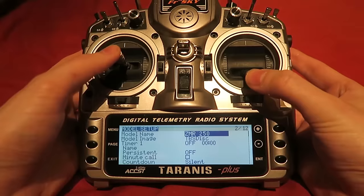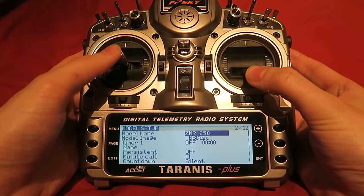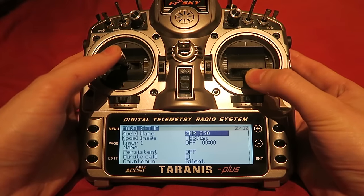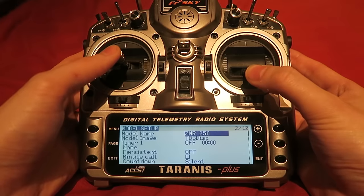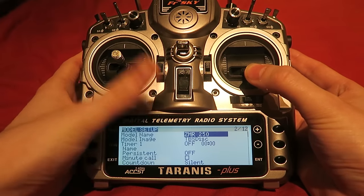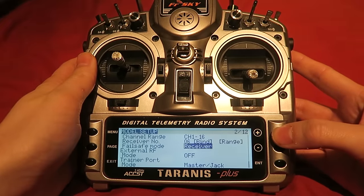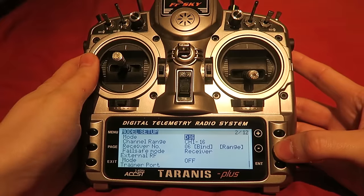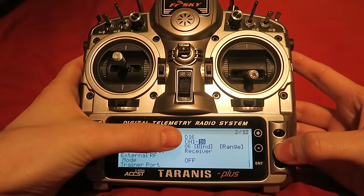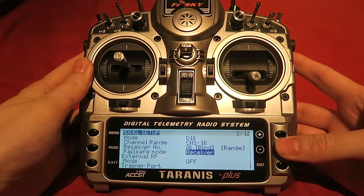Now that all the necessary wires are connected, we bind the receiver to the Taranis and set up our model. Mini quads are fairly simple, so this shouldn't be too taxing. I have created a model called the ZMR250. I have set the model image to TBS Disco. I have set the mode to D16 and our channel range from 1 to 16. I have set the failsafe mode to receiver.